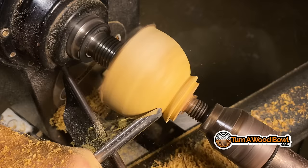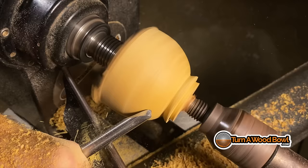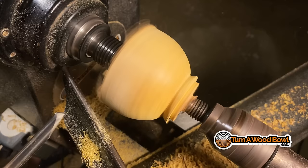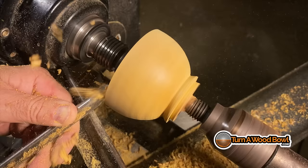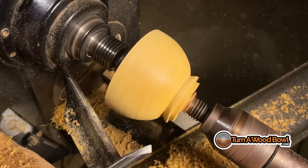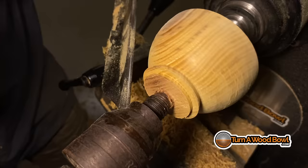I'm going to use some scraping cuts and then some shear scraping cuts. The scraping cuts are when the tool is close to horizontal or parallel to the rails of the lathe. The shear scrape — the handle of the tool is dropped at about a 45-degree angle — allows the tool to do a very light shaving of material instead of a deep cut. With the shear scrape you're very flexible on direction; it's the only time with a bowl gouge that you can move left and right without consequences, because it removes such a thin layer of material. You can see how thin and minute those little shavings are.